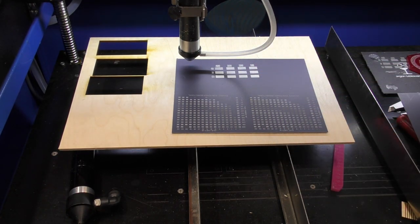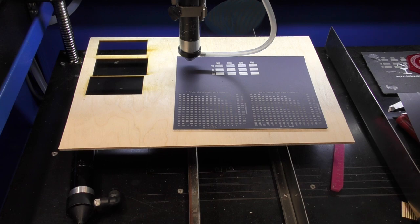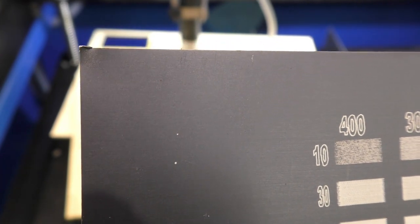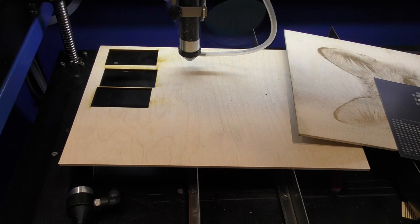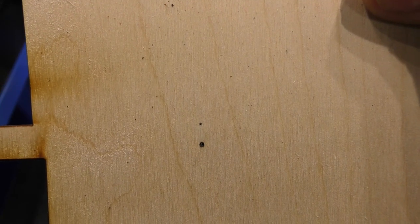is what I'm going to do here. Put a pulse, and you'll say, that's a very fine, small pulse. Move it. Let's hold the pulse on for a few seconds. One, two. Can you see the difference in the size of those dots? That's the point that I mentioned to you earlier. There is no such thing as a focal point. Certainly on wood, we'll do a pulse, and then we'll move it, and we'll do another longer pulse. What do you think about a focal point now?